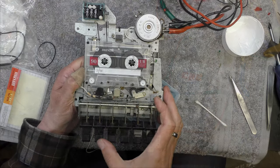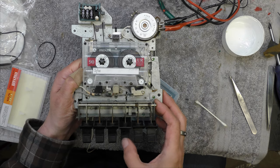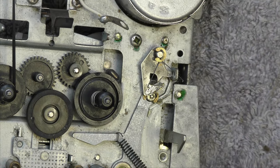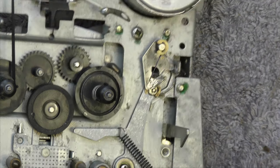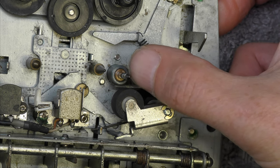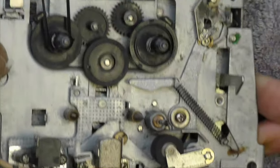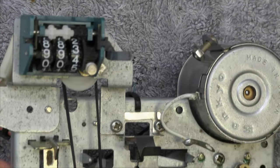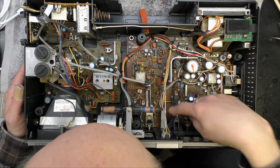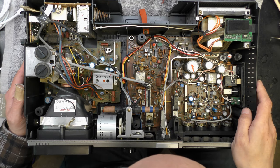Fast forward - yes! Play, pause - that's looking good. That's the pause mechanism nicely greased up now. Always got to remember to put that little rubber plastic bit back that stops the grease running up the capstan. It's obviously been a little bit damp. Here's a close-up view while the deck's out. The next obvious thing is to clean the pots and switches - hopefully I can get access because they were a bit flaky. I didn't have TV sound on the first attempt, so get the tin of contact cleaner on and get to work.